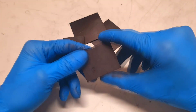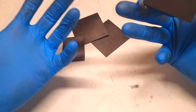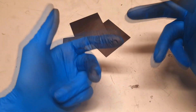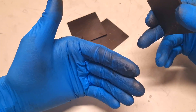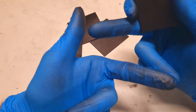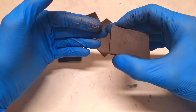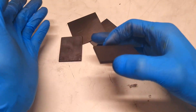If you look into making this kind of graphite plate, they are actually not so difficult to make, because only what you need are two materials. The first material is of course the conductive material, and the second material will be the binder. Sometimes you also need some solvent, but most of the time you only need the conductive material and the binder. For the conductive material you can use some graphite powder or carbon black, or even mix these two together. For the binder, it is better to use some epoxy, because epoxy is a really strong binder and in most cases it will not react to most chemicals.